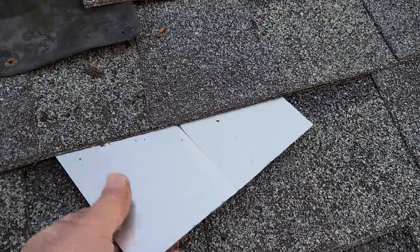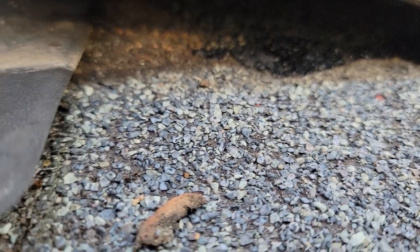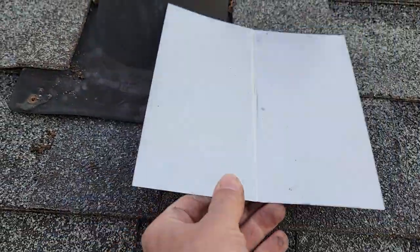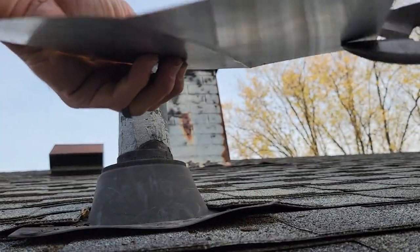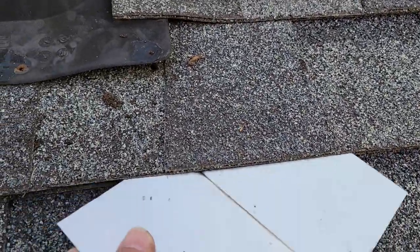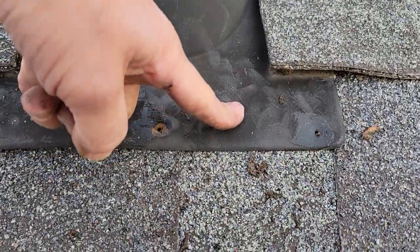On the other side we're hitting a nail too, so we'll cut a little U-shape or just cut the whole thing flat — it doesn't matter. The biggest thing is you want to make sure that piece of flashing is going to be up past the holes inside. It's covered now. We're also going to put some sealer to hold all this in, then drive two new nails pinning those pieces down.